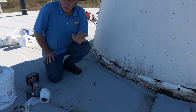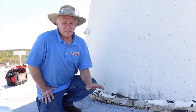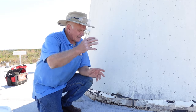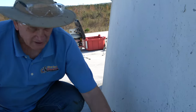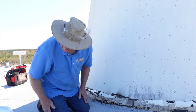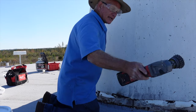The most important part of a roof, and also the last part of what you do on a roof, is the flashing. That is the most important part of any roof — the metal edging on the edge and the flashing. The roof itself never goes bad most of the times. But most of the times you have leaks around the flashing. What you normally have to do is clean the flashing — you clean it with a wire brush like this.